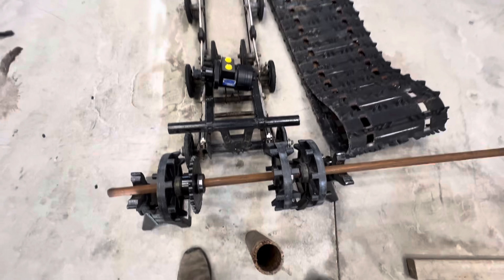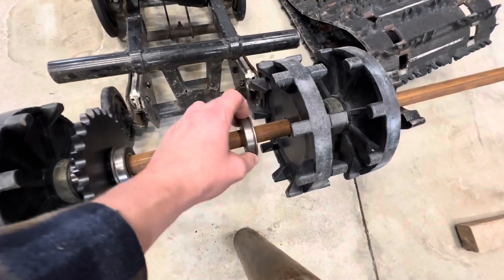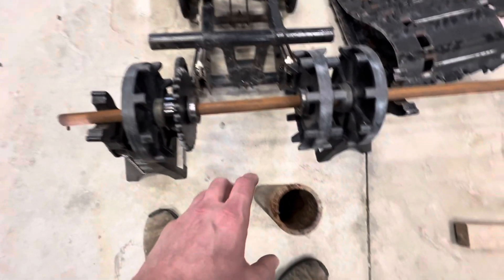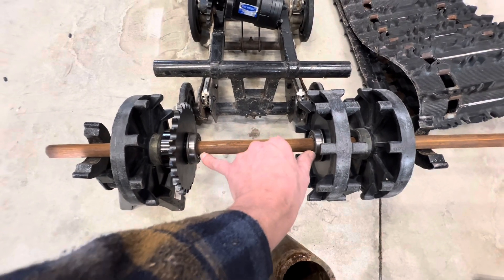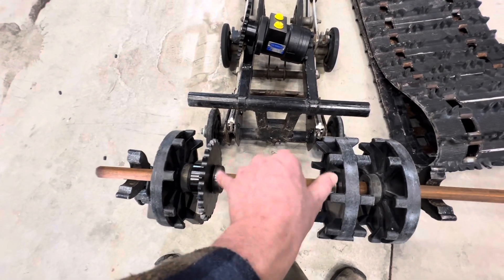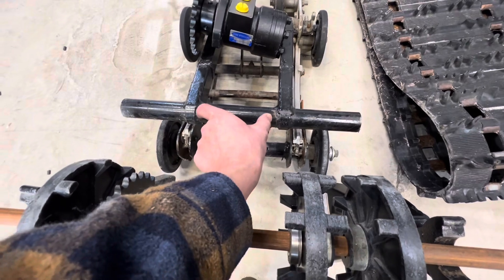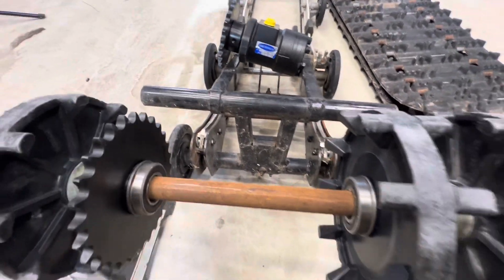Up at the front, you can see the drive axle arrangement. We have our outer track drive sprocket, our inner track drive sprocket, our flange mount bearing that's going to sit inside there, and our other flange mount bearing. This is our chain drive for the motor, and our other outer track drive sprocket. We're going to use a piece of this heavy-wall tube to make an actual carrier, where these two bearings are going to fit in. We want to make it as wide as possible to increase support capacity and reduce the moment of pivot on the track. There's going to be a lot of pressure on this axle, so the wider it is, the better it distributes the load. We'll then use a piece of rectangular tube that comes off the upper mounting tube, comes back, and triangulates down to the axle. That should be our track drive setup.